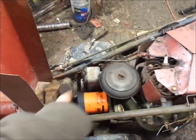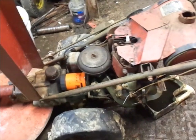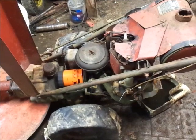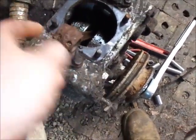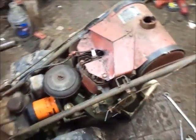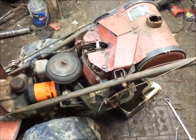And the mag has a tag on it, which I can't really read, but you guys can see the tape on it. So that probably said something like good or rebuilt and had a date. So we'll run through this and see what we get. So right now, I'm kind of just abandoning the 52. It's just so rusty and so far gone. Even the spray holes for the piston pin are rusted shut up top here. So that has me kind of worried about that motor to even monkey with it right at the moment. So I'm not saying it's totally done, but I'm going to concentrate on some other things right now. So anyhow, here we go.